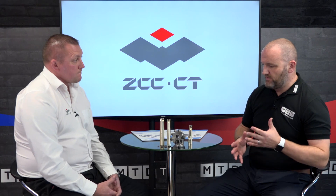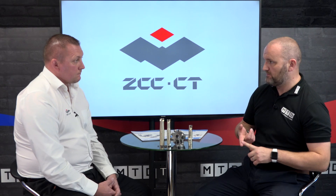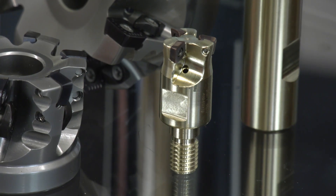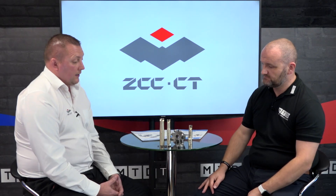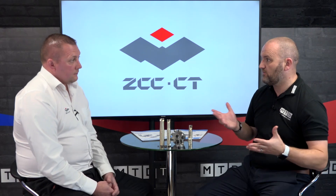And Hi-Feed milling — they're all slightly different, aren't they? Yeah. Can yours do face milling, ramp, interpolate, plunge? Yes, this system is great for us, specifically the SD style — we are shoulder milling, face milling, and plunge milling. Then with the benefit of the W-style and APKT style we can now also go into solid. For tooth load on carbon steels, we are running on the SD style up to 2.5 per tooth at 2mm depth of cut — impressive stuff.